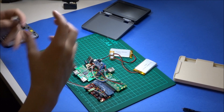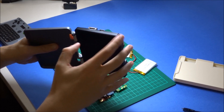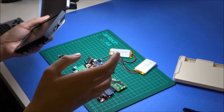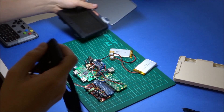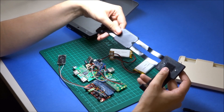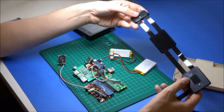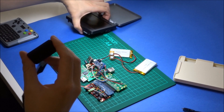You may be wondering how the monitor would connect to the console. You've got HDMI and USB on the side here, and to deal with that I've developed this solution using both an Adafruit and some non-branded DIY FPV cables. We've got both HDMI and USB, and on one side you've got full HDMI and micro USB. If I just plug that in like so, it goes into this adapter that flips the cables 90 degrees so they go vertically down, and then when it's in handheld mode this would clip in place, leaving minimal protrusion.